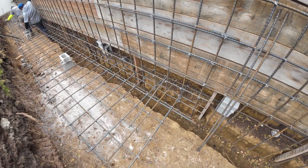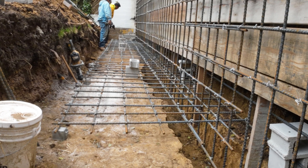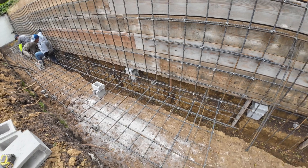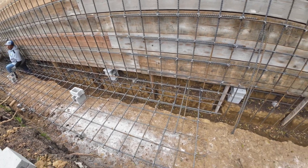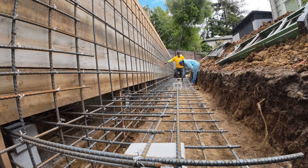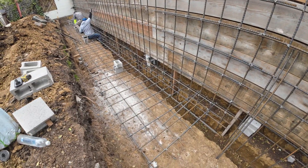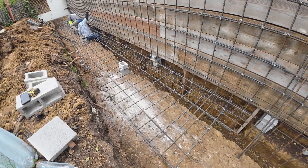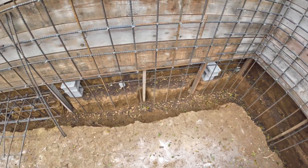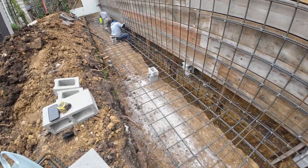So we have about — how wide is this footing? Six feet wide, 18 inches thick. We got a keyway here because of this hillside, which is approximately supposed to be 12 by 12, but it looks like it's a little wider than that. Normally when you start digging keyways they just tend to spread, which is kind of what happened here.